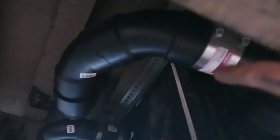Number eight wire — you get that right, everything else falls into place. Those two black pipes coming out of the tanks are my vent pipes. This one right here is the shower p-trap, and that runs along to the other side of the tank where the toilet is. This one goes from the toilet down to the tanks, and that one goes to the sink and shower. This project has taken me forever and I feel like it's done now, which is a huge win. The only things left to plumb in are the faucet in the kitchen, the shower head, and the toilet — everything else is done.